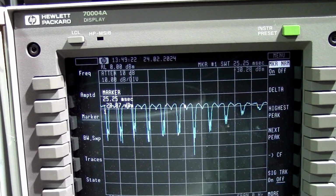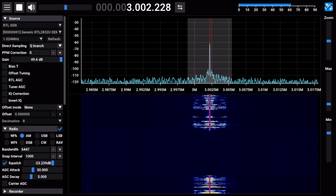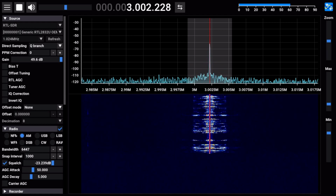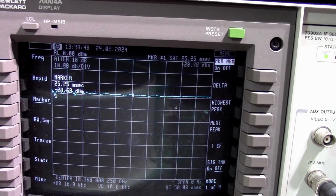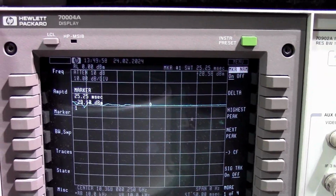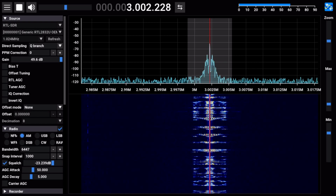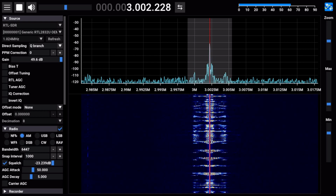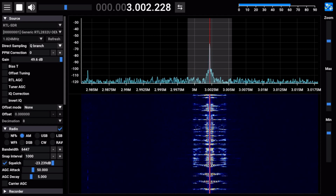Now let's listen to my modulation. So here I am about 3 inches away from the microphone. It is, as you can see, acceptable as far as the quality of the sound goes. It's not great by any measure, but I could certainly use AM, though it's not my main intent. Before I increased the attenuation into the IF attenuator, it was way too distorted. We could barely hear what was said. It was just saturated more or less. No headroom for modulation. So now it's better.